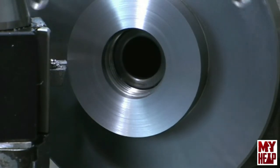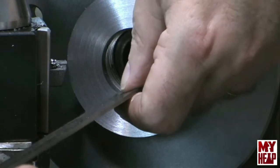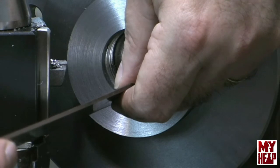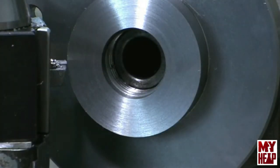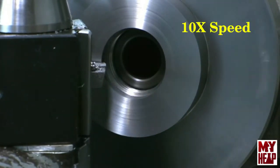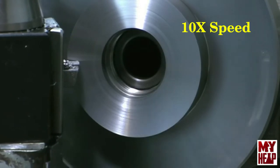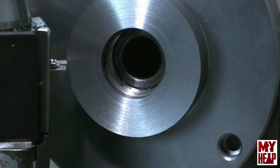Let's take another measurement. I'm looking for just a hair over a quarter inch and that looks to be about right where I want it, at least according to my rule. I'm going to take one more spring pass without making any adjustment to the tool, just to see if it knocks anything off. I think that's that.